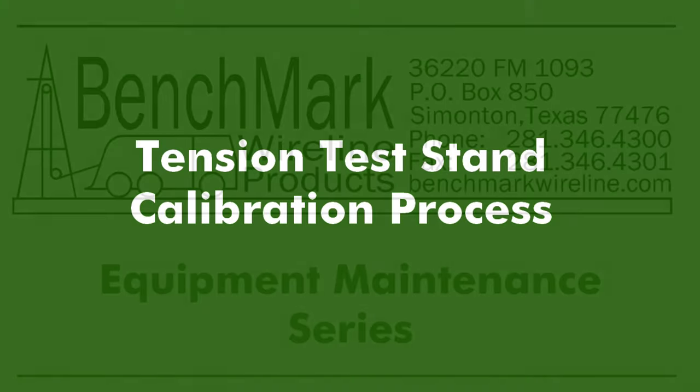Performing a t-test. A t-test is a well-site pre-job validation test. On the panel, zero out depth and tension and then press t-test. That value should be approximately 10,000 pounds depending on the load pin. This verifies that the signal is going out the panel, through the cable, to the load pin, where the resistor is, and then back to the panel. It verifies that all components are online and the signal is passing properly. It also verifies that the panel can be zeroed.